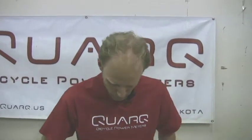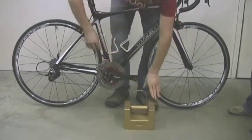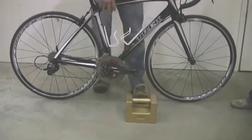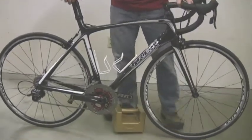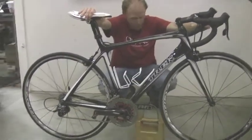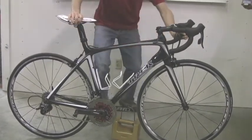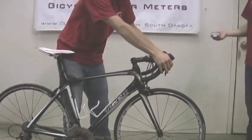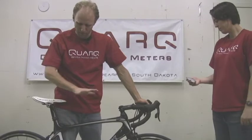If you have a single speed, you'll typically use both right and left crank arms, but you don't have to use the big and little chain ring — you can just take two measurements in your single front chain ring. The graphic shows us the little chain ring on the non-drive side crank. We clip the weight underneath and roll the bike back a little until the cranks are level. An assistant helps here because you need to make sure the crank arms are very level. You could use a level or other measurement device, but you can actually eyeball this pretty well. Your eyes are usually good at judging whether things are parallel, though it is a source of error if the cranks are at the wrong angle.